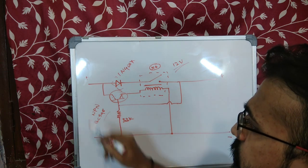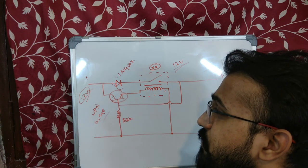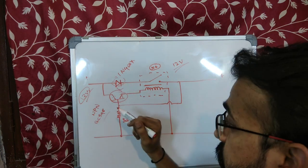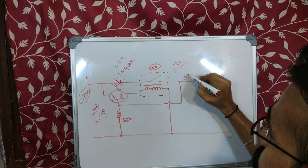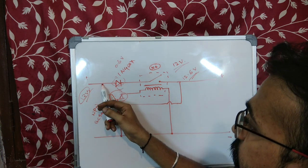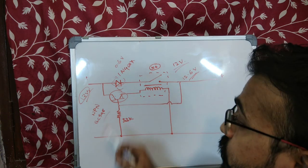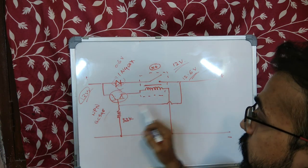This is a simple circuit. Once you connect the voltage — say 13.2V, which is a lead-acid battery at full charge — the voltage on the other side will have a drop of 0.6V because there is a diode connected here, making it about 12.6V. The reason for using this diode is that the collector and the base are connected to the same positive rail. If you don't connect the diode, the potential at both points will be the same and the transistor won't switch on. With the diode, there is a 0.6V potential difference between the collector and the base, which switches on the transistor.